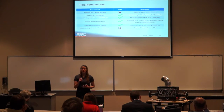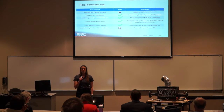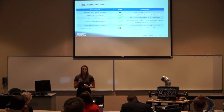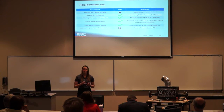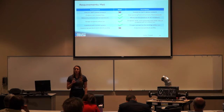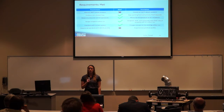Our project needed to meet several requirements. We did not fully meet the 300°F temperature rise, but achieved 167°F above ambient. On a positive note, we produced non-vitiated flow through our cross-flow heat exchanger, keeping the two fluid streams separate. We successfully measured all required pressures and temperatures, designed and built a functioning propane orifice run to acquire fuel mass flow rate, and acquired a temperature profile at the exit of our air heater. However, we were unable to acquire a velocity profile.